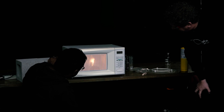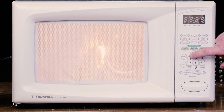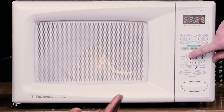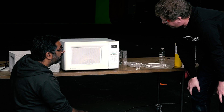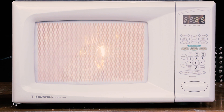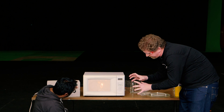How far can you take this? You can melt it pretty much all the way to slag — make it fall apart. The hard part is after you're done melting it as much as you'd like, because the glass then has no way to be tempered. Tempering glass — the problem is that glass doesn't conduct heat super well. So different parts will cool off at different rates. If one part is really hot and the other part is cold, they have different amounts of expansion, and they will crack as they cool off and shatter. So it's not a great way to blow glass at home, but it is cool.